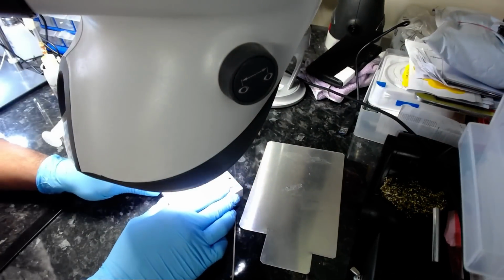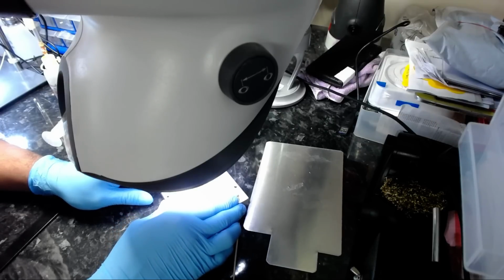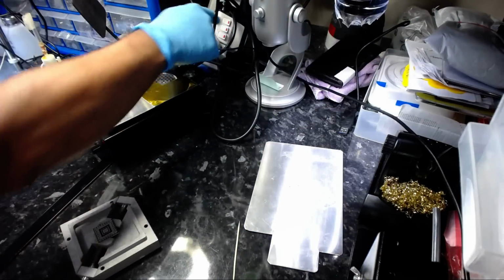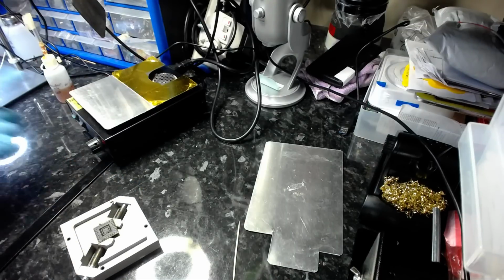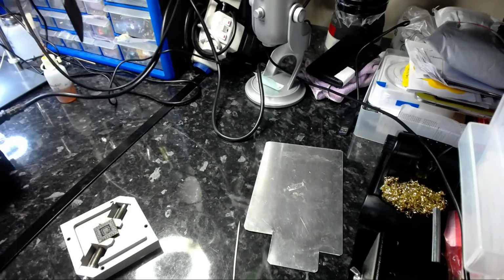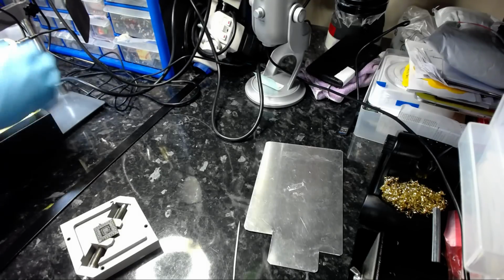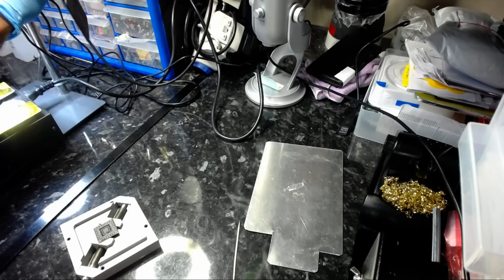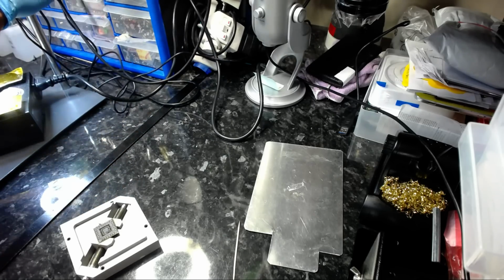Right, okay. So we're happy with all the solder balls in place. Fantastic. Now what I'm going to do is put that back in its place. Now I'm going to use a preheater. You're probably wondering why you need a preheater. You'll find out soon enough. Let me just lift this up. In fact, I'm not going to lie, am I going to be able to do that? I don't know. Should be able to.